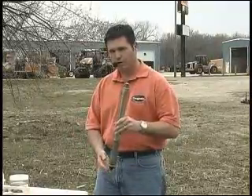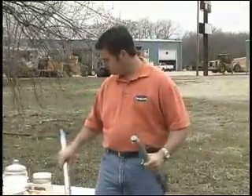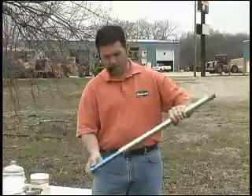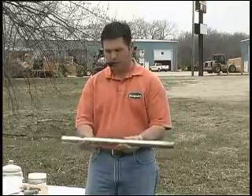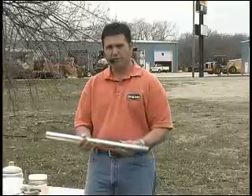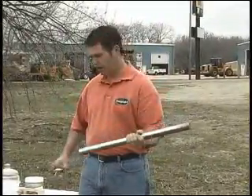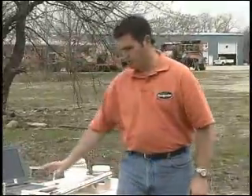Normally we would pre-probe and then begin pushing this. To make it cordless, this is a digital cone. What we have is a sound transmitter. The sound transmitter has a battery section — six C-cell batteries go into it. This section is comprised of a one-foot or one-and-a-half-foot area. The other portion of this is the sound transmitter. When this is together, the digital signals are sent up this rod string and into the next component, which is the microphone.